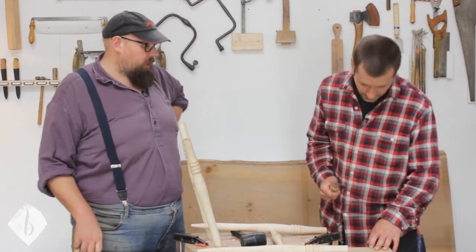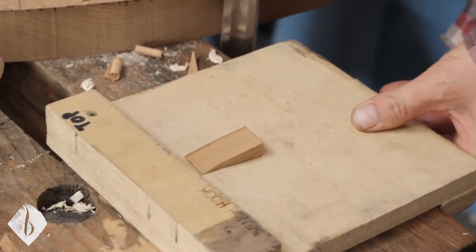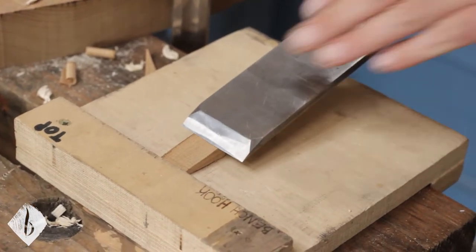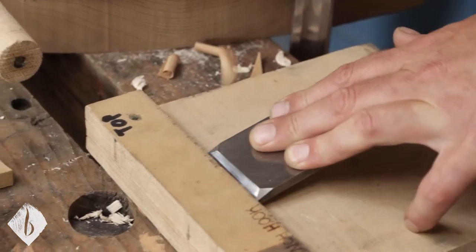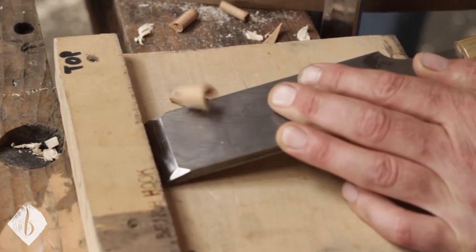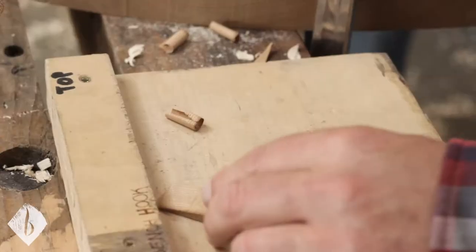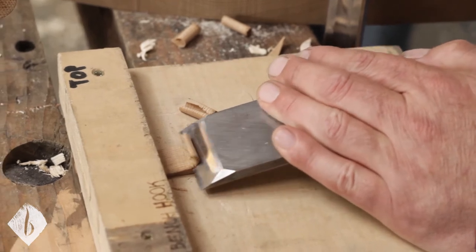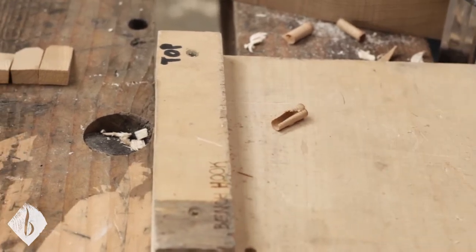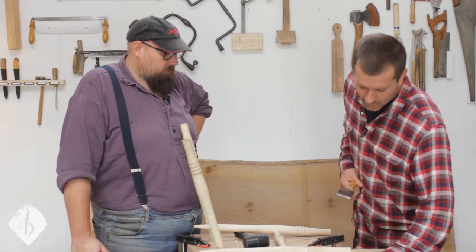This is a great technique for tidying up. We've got a bench hook with a little bit of wood so it won't slide. With my hands well away from the front of the blade, I'm just going to put the tool on the wedge and peel off the shaving. You've got to be super careful with chisels - probably the most dangerous tool in the workshop. People often put their spare hand in front trying to hold the piece, which makes you shudder. It's all about having a wooden version of that hand in front of you.